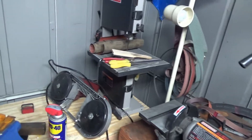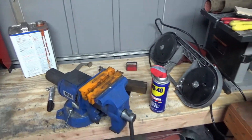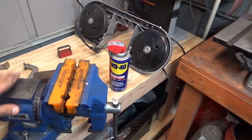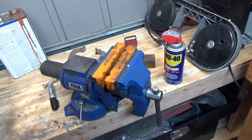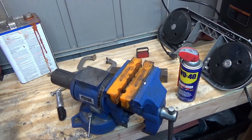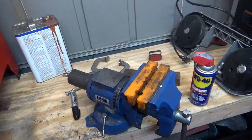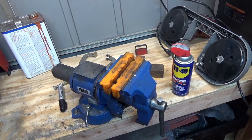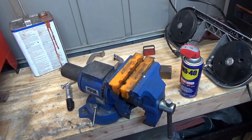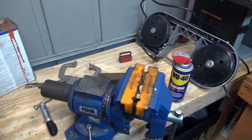The buffer and all that stuff, yeah, that's important too, but the most critical are the grinder and wherever you plan to hand sand. So I put my other light over here now to light up the vise. You want it super, super bright. If you can, swing a spotlight around this way when you're hand sanding. If you've ever hand sanded before, it takes hours and hours and hours. And if you get all the way through it and then you realize — let's say you're going for a 2000 grit finish or a mirror polish — and you buff it up and then, uh oh, you realize you have a 220 grit scratch right in the middle of the blade. Now you have to go all the way back to 220 and do it all over again.